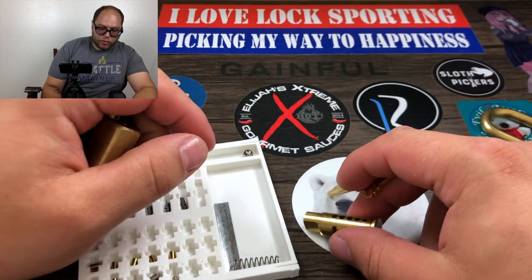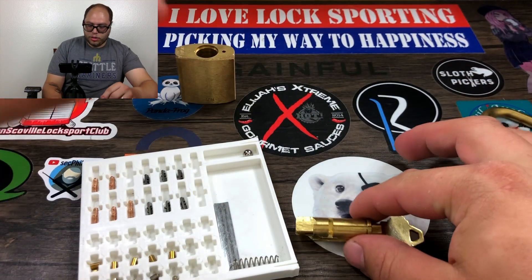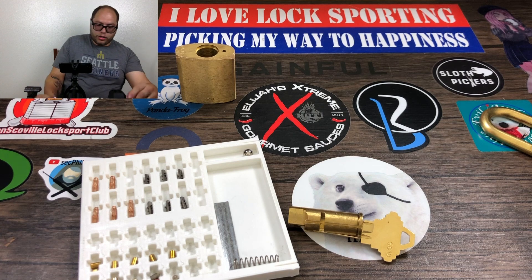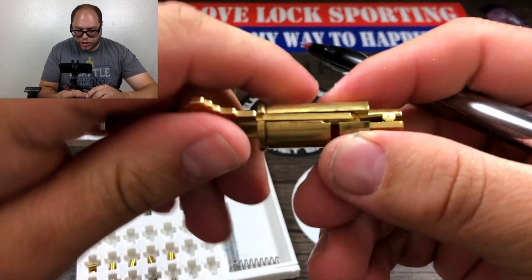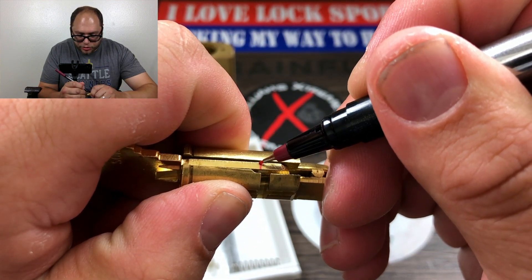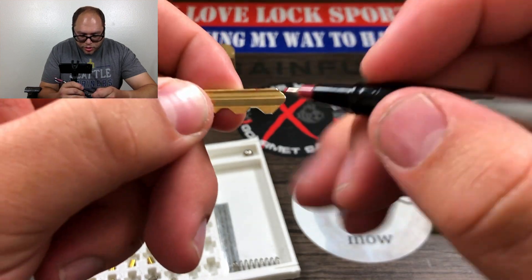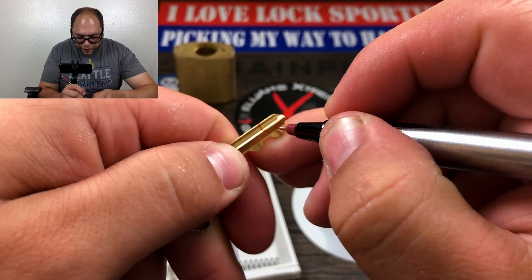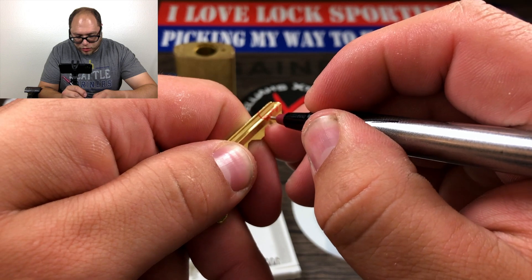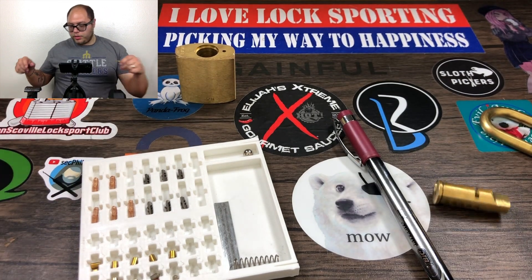So what we need to do to make this gut key - we need to insert this and take this Sharpie and mark where we need to cut on this key, because we don't want it to block this channel. We need to cut it to at least right here, and we're going to cut it to this wording right here. So we want to grind this down to - imagine it's a straight line going there. Let's go ahead and clamp this in our vise over here.